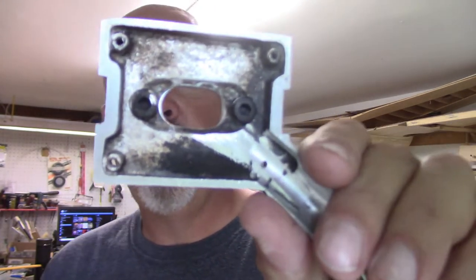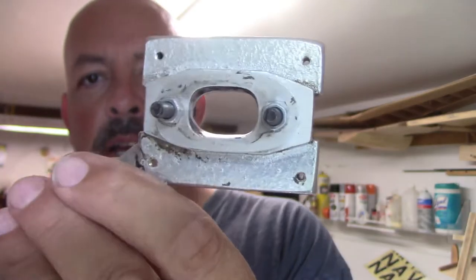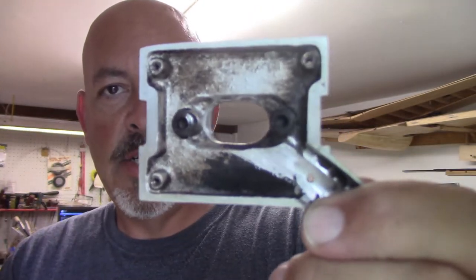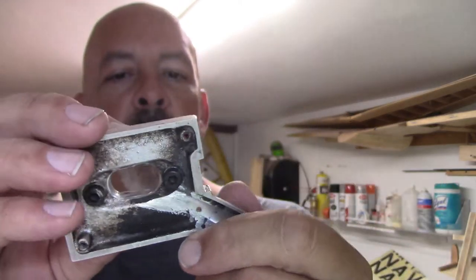Now, the changes I made to the muffler. I'm hoping I showed it earlier in the video, because we had a lot of issues. This was blocked off. The hole in the muffler itself was different than the standoff, which is a separate standoff. So I went inside and just caressed it. I wanted to make sure the cylinder port and the muffler exhaust port relatively matched. It is a two-stroke, so it'll help it flow better. I'm hoping I took video of that, because I didn't take pictures.